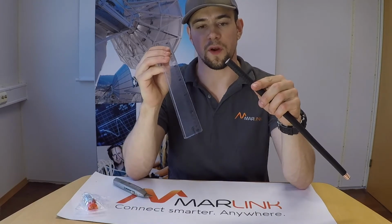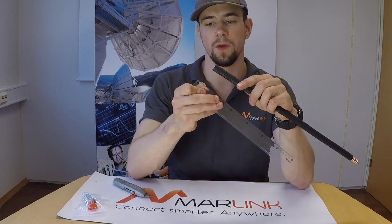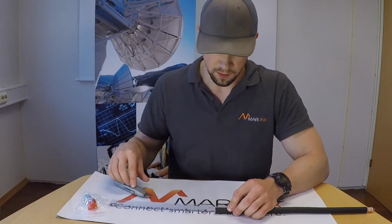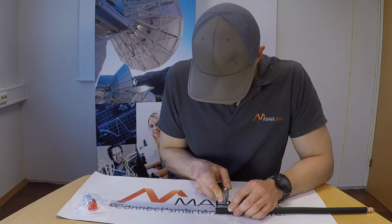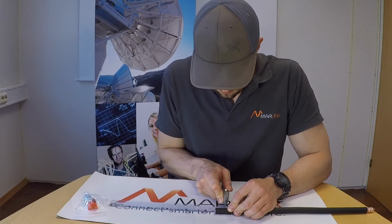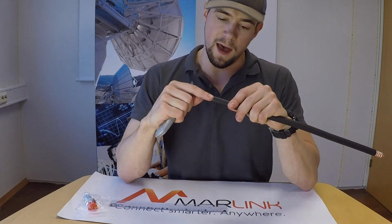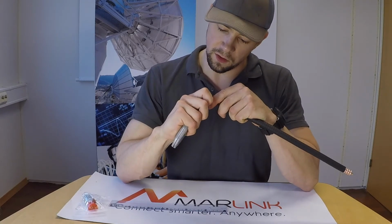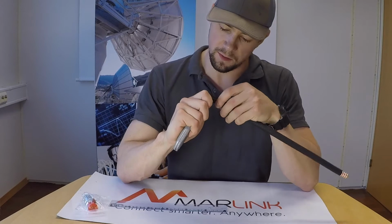For the next step of the preparation, you will need a measuring tool, either a ruler or a set of calipers. Place the ruler on the tip of the cable and measure out 25 millimeters from the cut. Then grab your carpenter's knife and place the blade where the 25 millimeter mark will be. If you made a proper cut through a valley in the cable, you will see that the blade of the knife will also be placed on a valley at the 25 millimeter mark.